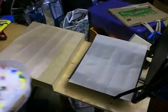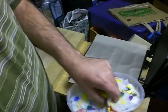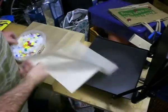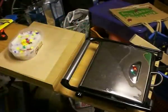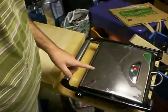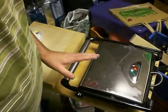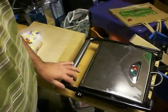I've got about 200 grams of mixed, cut-up HDPE plastic from milk bottles and bottle tops. I'm going to heat up the sandwich toaster first. You might be thinking I'm mad doing this indoors because of fumes, but this sandwich toaster heats to 180 centigrade — just the right temperature to melt HDPE without burning it — so there aren't any fumes. It makes very little smell, very little mess.